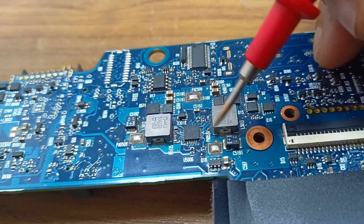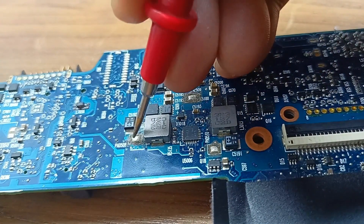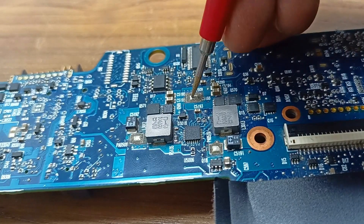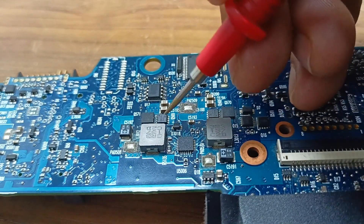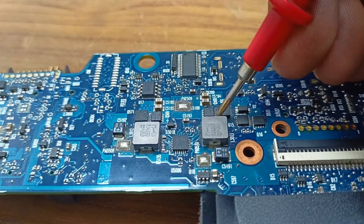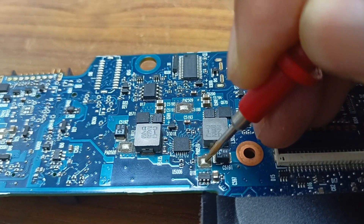You can see here, there are some points where there should be some voltage — here should be present 3.3 volt or 5 volt, but here there is no voltage present. Let's check here — yes, here is 5 volt present, 5 volt is okay. And this area is 19 volts, that means this is the MOSFET input voltage. This oscillator IC works for the 3.3 volt and 5 volt and other voltages. The 5 volt is present, meaning this MOSFET input is working well. Maybe this coil works for 3.3 volt, but here there is no voltage present.